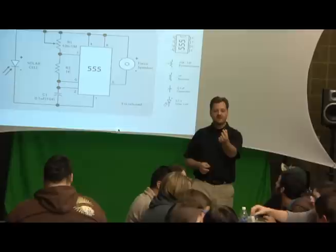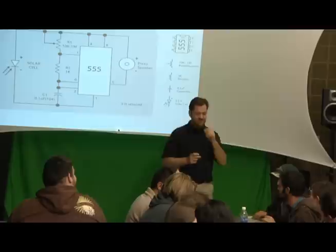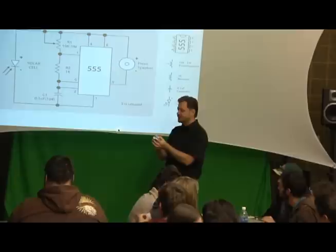One other thing about all electronics is that sometimes these things are polarized. Now, what was your name? Nate was telling a story earlier about how he blew something up because he put it in backwards. He was very proud of himself. So, Nate, you'll be happy to know that the resistors that are getting passed around don't have polarity, meaning they don't have one side or another that has to go in one direction. But some capacitors do, and the easiest way to tell, it's not always the case, but most of the time, when circuitry is polarized, one leg is going to be longer than another.